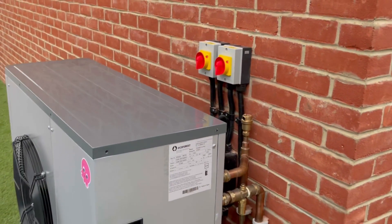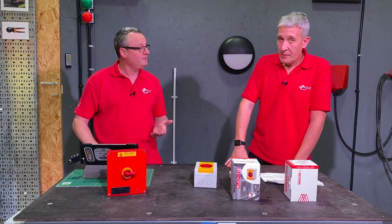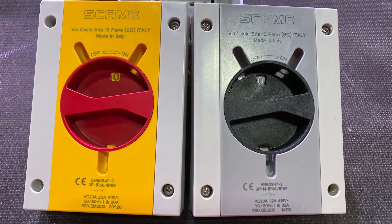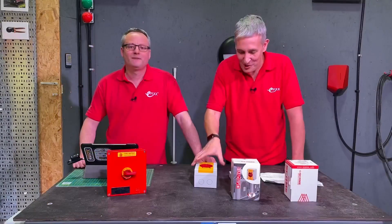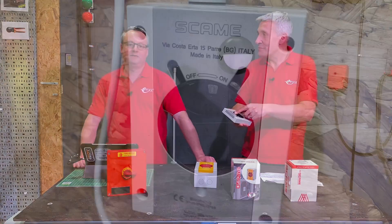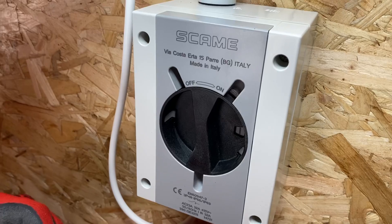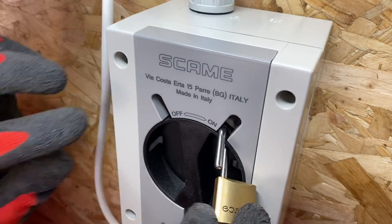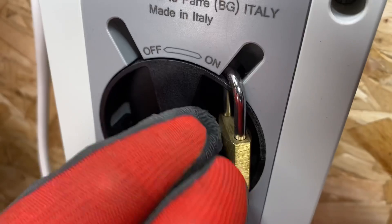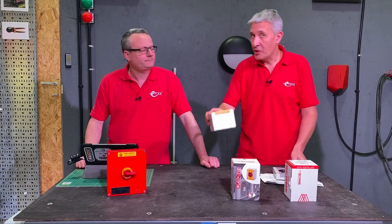Please leave your comments below on that one. We think design-wise there's one that's more pleasing to the eye. We think it should be a gray and black isolator. So gray and black — if I'm remembering correctly, those are the isolators you can lock in the off position and also lock in the on position, whereas the red and yellow ones you can only lock off.